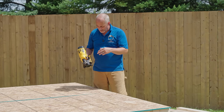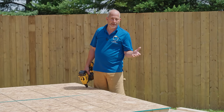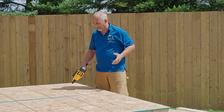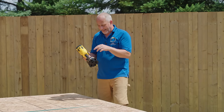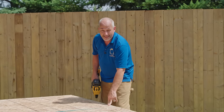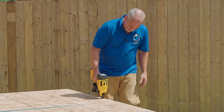A couple of things to consider: I'm using 1-1/4 inch galvanized. Because there's no code we can do whatever we want — you can use a large crown staple if you like. But the sheathing has two functions: it squares off the wall and provides shear strength so the wall won't collapse. With an inch-and-a-quarter nail in material that's half-inch thick — seven-sixteenths, but we'll call it half — that means I need three-quarters of an inch inside the stud. Three-quarters plus half — perfect.